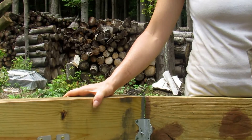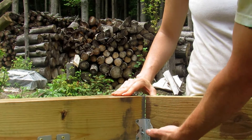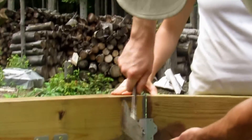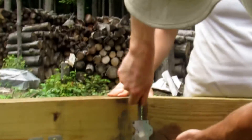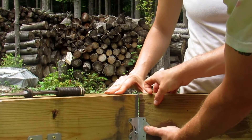There are three screw holes on the bottom of each of those. Put screws into those before bending the end joist as well. Apply pressure to the board inward again and hammer that out until it's flush.